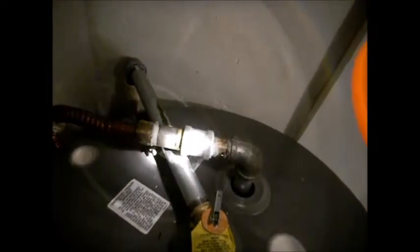So the electrical's good — we just need a couple of extra plumbing fittings. We got the water on. This is basically your bleeder and your pressure relief valve — sometimes they're on the bottom or the side; this one's in the center. You basically have to bleed the tank: fill the water in and let the pressure out here, otherwise you're going to have a bunch of pressure cycling on and off. Once it's filled up, you shut this off before it drips down. I actually used the old connections, and I got the word from a man that you always want to double-goop these seals, so I put Teflon tape and Rector Seal pipe thread fittings.